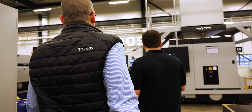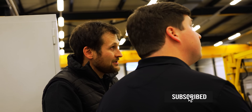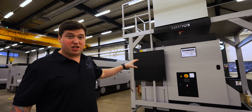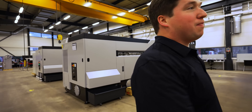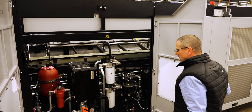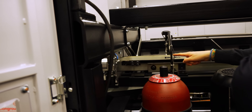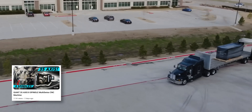That's starting to look like the Terminator. So this thing on top is when the Multi-Swiss has an integrated fridge — when the customer has a heat exchanger in their factory we just have the connection, but we still have to test the machines, so we go with a fridge on top. Look at the manufacturing power here — each one of these machines has eight spindles, replacing eight Swiss machines potentially. So you have eight spindles here, eight here, another eight, 24 spindles, and even one more Multi-Swiss at the end — 32 spindles from end to end just in these four machines. You can load up to eight tons of material with the bundle bar loader and an overhead crane, and the machine will take one bar to the other. You can run basically forever, almost.